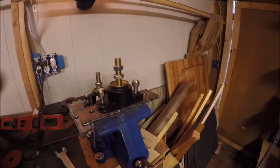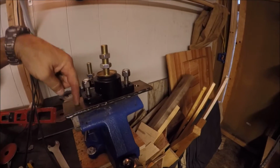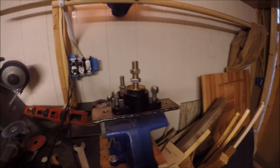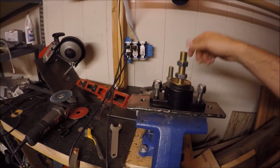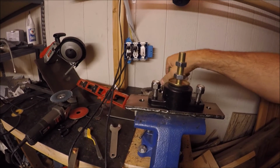So when I get back to the boat, we are going to install these. We'll pre-drill into the wood through here, and then I've got half-inch stainless steel lag bolts that go down in through here, and hopefully we can get it all adjusted. So we got good prop shaft alignment.